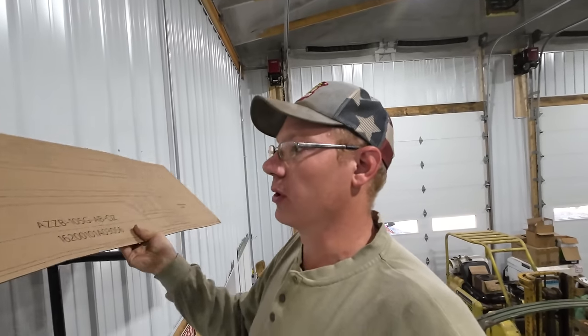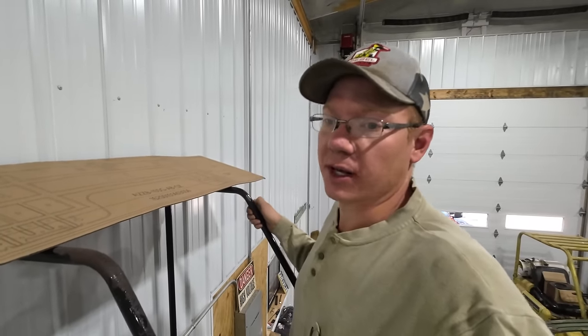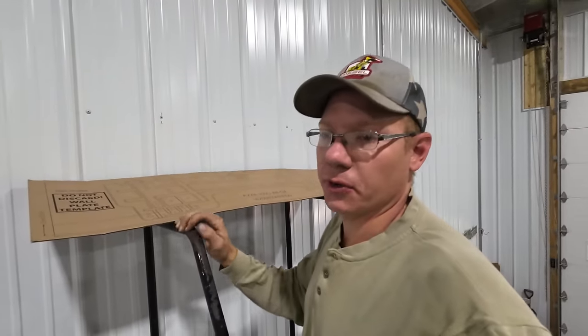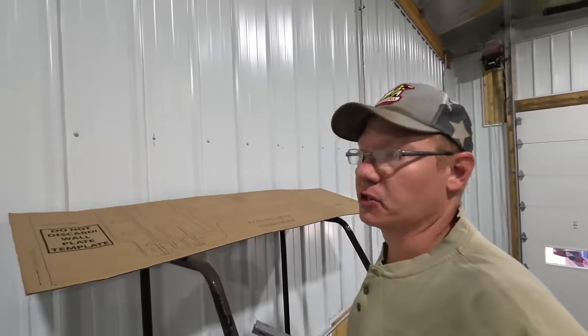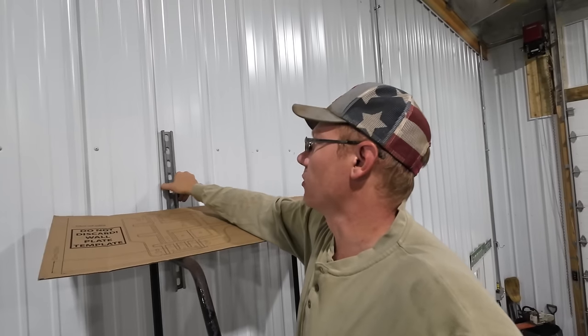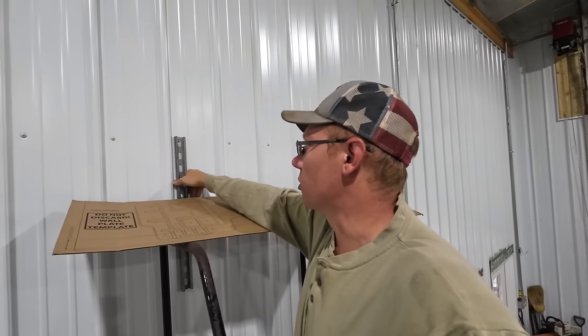I don't have my wood boiler set up yet. So until such a time as the boiler is up and running, these things are gonna have to be my heat source. My installation is gonna be a little bit more difficult than you would have on just a regular drywalled wall or a wooden wall or something like that. What I actually have to do here, because of the ridges on the wall, is space the mounting points back above the ridges. So I've got some Unistrut here.